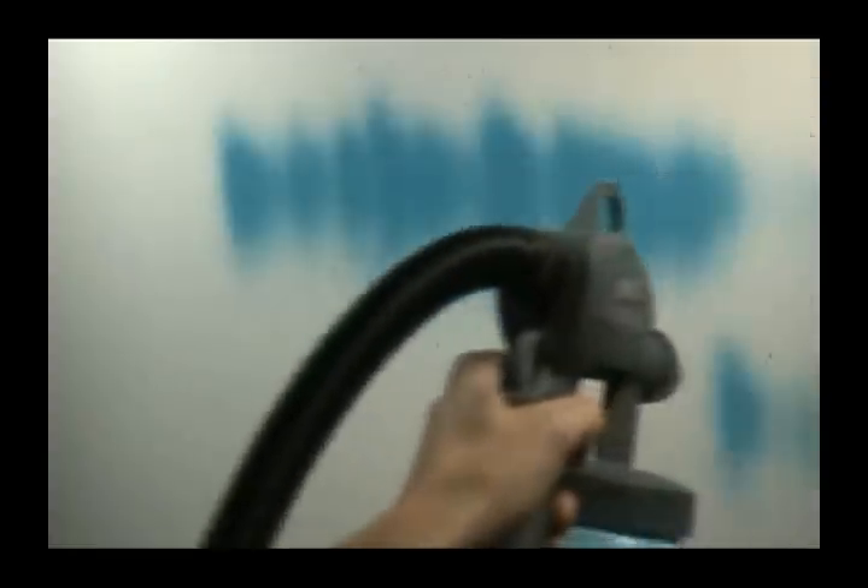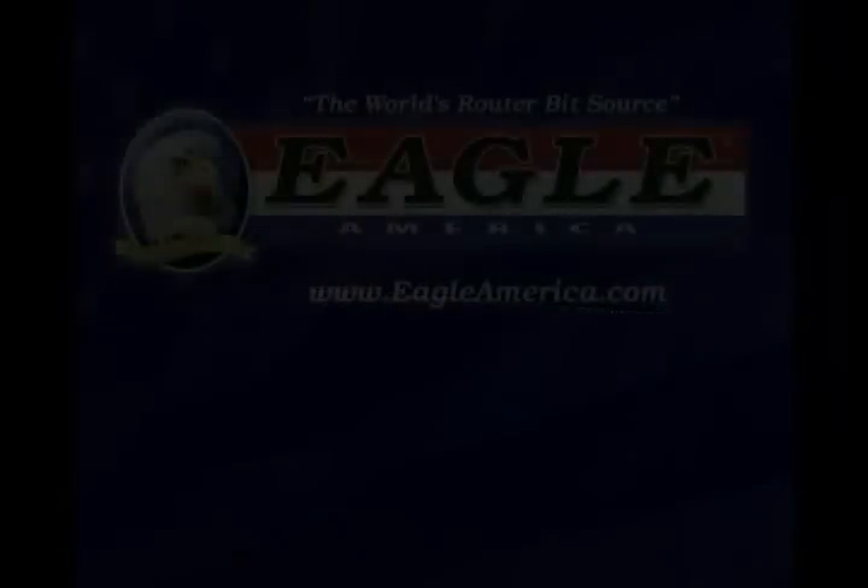Troubleshooting. Paint splatters — the viscosity is too thick. Action: review the viscosity by referencing the thinning section in your instruction manual. Light coverage of paint — action: increase paint flow rate or spray slower. Sags or runs — action: move spray gun faster or reduce paint flow dial and spray a lighter coat. Orange peel — action: reduce viscosity, increase atomization with a smaller fluid tip, the spray area may be too cold, or the spray gun may be too far from the object. Too much overspray or fogging in the room — paint flow is too high and you are spraying too close to the surface. Action: reduce paint flow and move further from the surface.